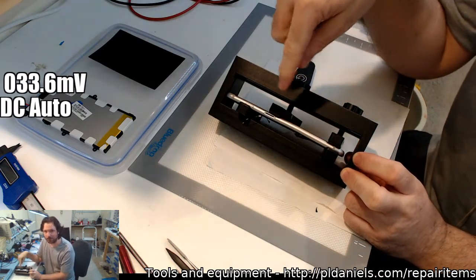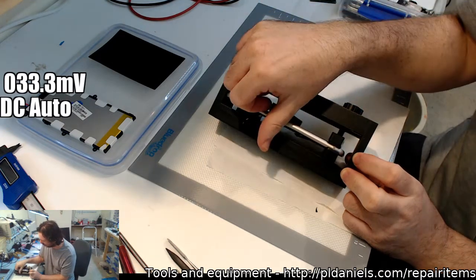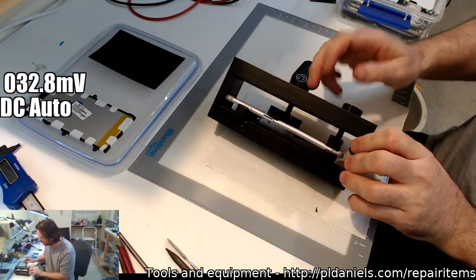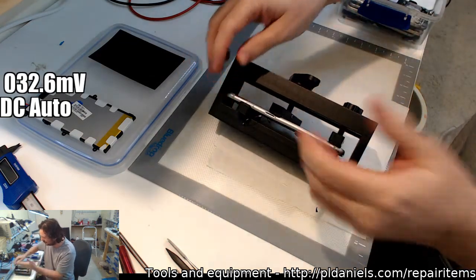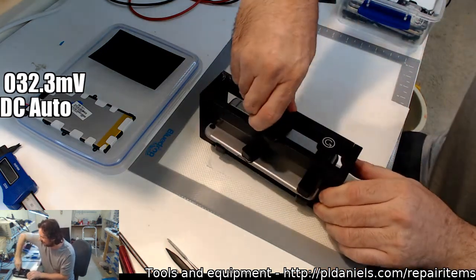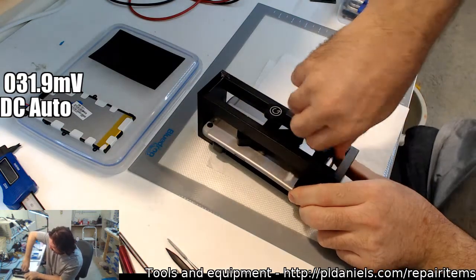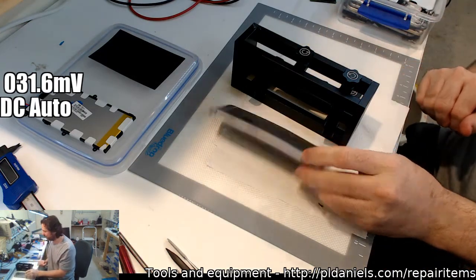And if you know anything about metalwork, you know if you want to get that bend out, you have to actually push it beyond straight. You have to overflex it, overpush it, like about another couple of millimeters at least, so that when you let it go, it springs back to straight. But these things won't let you go past dead straight. So all they're designed to do is to take the thickness of an iPhone, press it straight into straightness like that, but it's no good because when you release it, there we go, it just comes on back like a bad nightmare. And look at that, absolutely no effect, completely freaking useless.